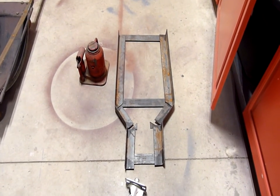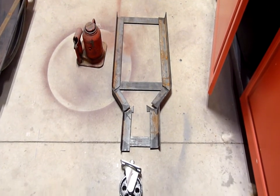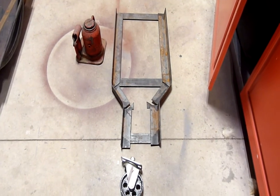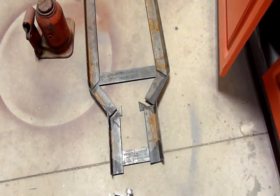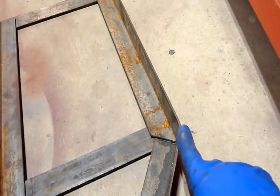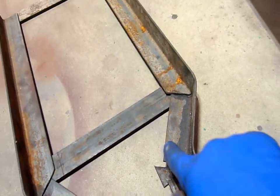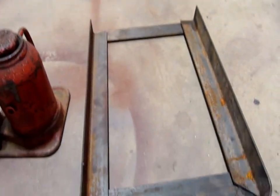I'm still trying to figure out what exactly I'm doing, which is nothing new. So, this is what I originally thought of for a base. I just took this 1½ inch angle iron, cut it where I wanted, and bent it — 45 degrees. I cut out a 45-degree notch so I could bend it, then use the pieces to fill the gaps and grind them off later, and weld the cross pieces on.